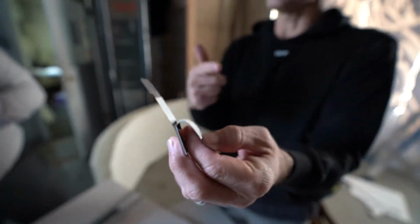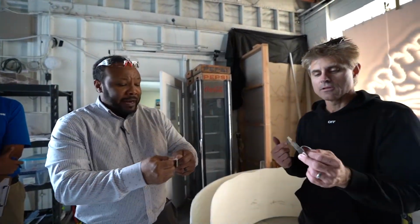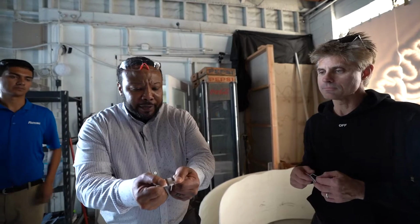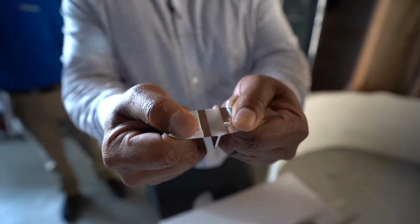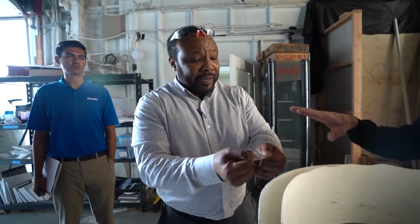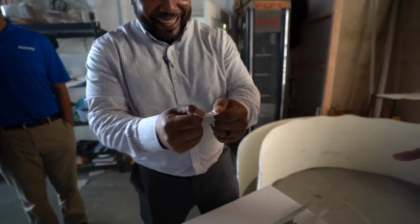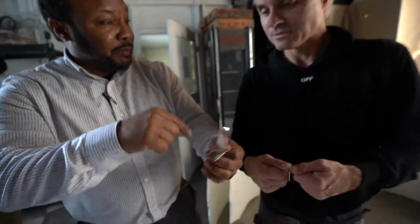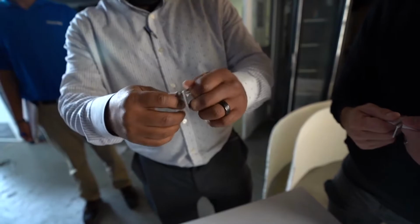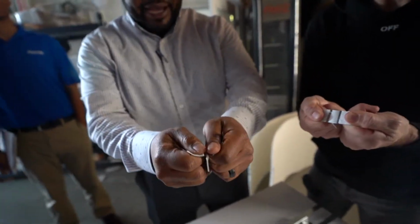And what is that part called? We call that viscoelasticity. The tape flows. And if I pull it real hard, after a while I'm going to need less stress to hold it there, because the tape is absorbing that energy. You're getting into some interesting science there. You've got some big arms, and I know you probably don't have to go to the gym because you just pull on the tape. So this is 1 square inch of tape. It takes about 60 psi to rip this. You can't rip it by cleaving it. You just keep bending over and cleaving it, but the tape expands, it goes back.